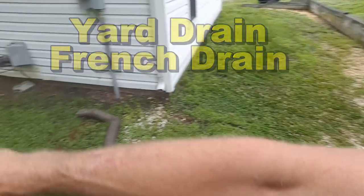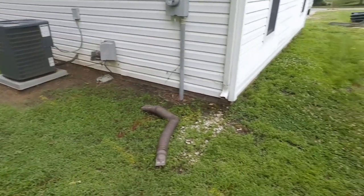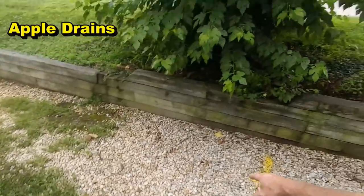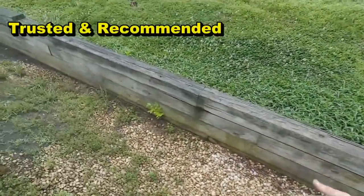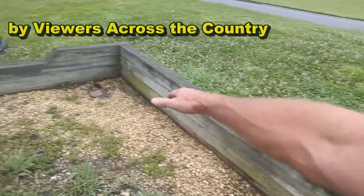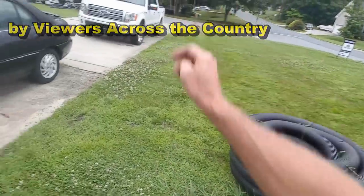And we're going to trench starting over there at the patio catch basin. Line comes around, turns, and goes all the way out to the street. We'll pick up the downspouts over here where they throw in some gravel. We will put the French drain. We're going to use the easy flow and perforated pipe surrounded by gravel. Comes down, turns, it'll tee into the line here and continue on out to the street.